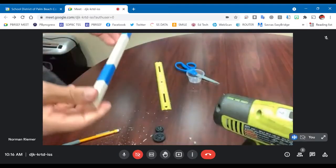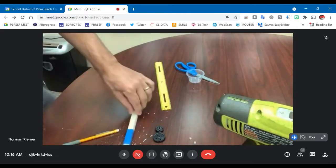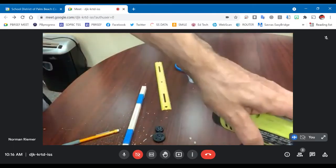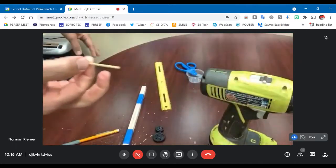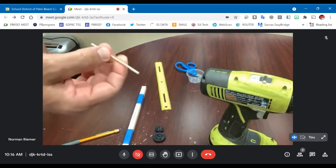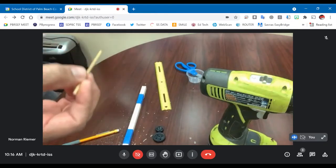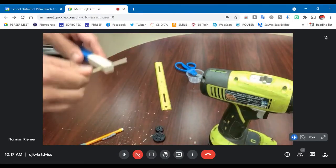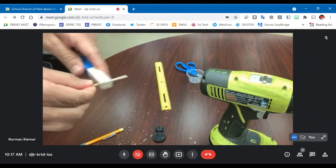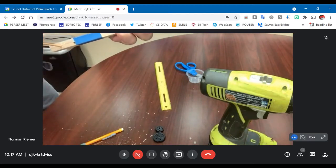Now I've got my frame pieces drilled for the size axle I'm going to be using. The particular drill bit I used was the correct size for the axle pieces I'm going to use, which happens to be one-eighth inch axle pieces. If your axles are going to be thicker, then you have to adjust your drill bit size accordingly. I'm just going to do a quick test fit to see that it fits and turns nicely.